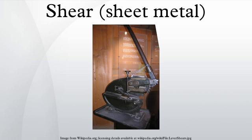There are many types of shears used to shear sheet metal. Types: alligator shear, bench shear. A bench shear, also known as a lever shear, is a bench-mounted shear with a compound mechanism to increase the mechanical advantage. It is usually used for cutting rough shapes out of medium-sized pieces of sheet metal, but cannot do delicate work.